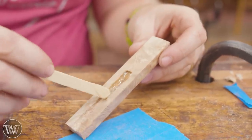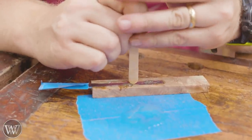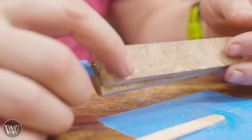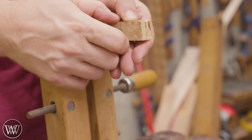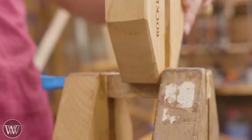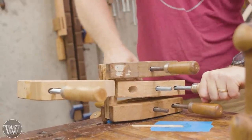I'm going to use some 30-minute epoxy. I wouldn't use a 5-minute epoxy on this — I want something a little bit stronger, but 30-minute is usually a really good balance. So I'm going to fill up one side, push it down in there, make sure it squeezes up all the way around it, then smear it on the other side and put the two together. You don't need a huge amount of clamping pressure — just clamp it until the gap is closed. On this one there was a little bit of twist in it, so I had to put a little more force into it as the live oak loosened up. We can put a few clamps on there and set it aside to dry.